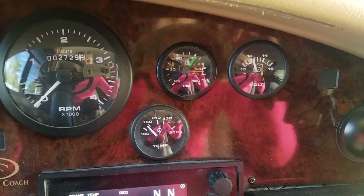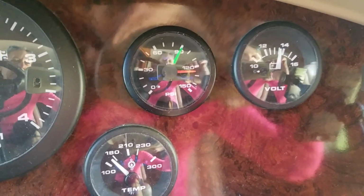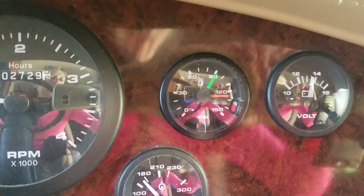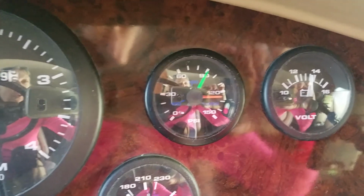Now I'm going to start the engine and let's see what happens. I think we might see interesting things. I don't know. Here we go. So the alternator is around 12. There's a buzzing noise right down here that I do not remember ever hearing before. Oh, well, of course, the amp meter went right up to 14, just like it should, because I am making this videotape. But prior to this, it was surging back and forth between 12 and 14.